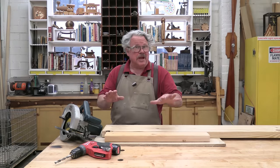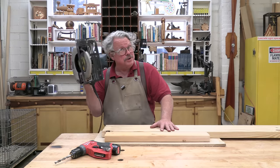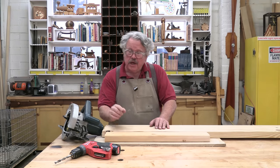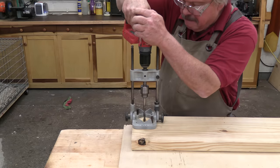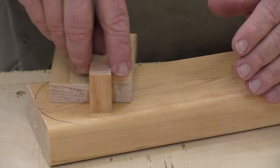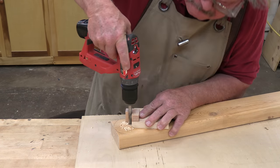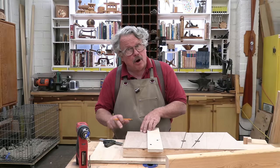And now for the magic trick that I promised to show you. We're going to round over the top corners of the rails and the top ends of the lifting arms using a circular saw. But first, we have to drill 3/8 inch or 10 millimeter holes in the rails and the arms. Now if you don't have a drill press, drilling holes square to a surface can be quite a challenge, but I have two suggestions. The first is to use a portable drill guide when making these holes. This keeps the drill properly aligned to the work. The second is to make a portable drill guide — this is just a vertical V jig. Keep the bit cradled in the V as you work and the resulting hole will be reasonably square to the surface. Also, drill a hole in the sawing jig through the table and partway into the base.